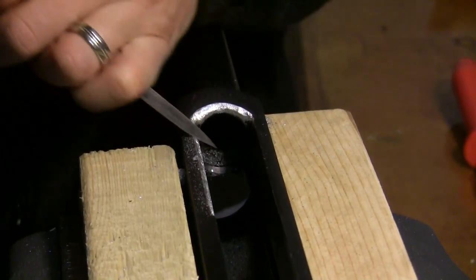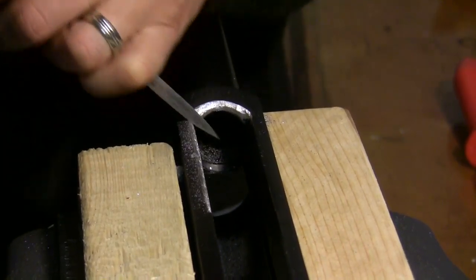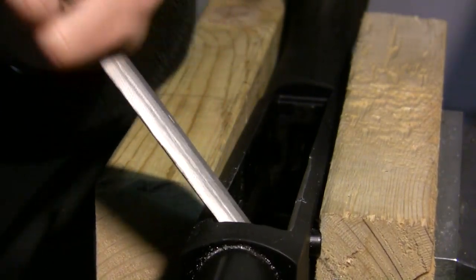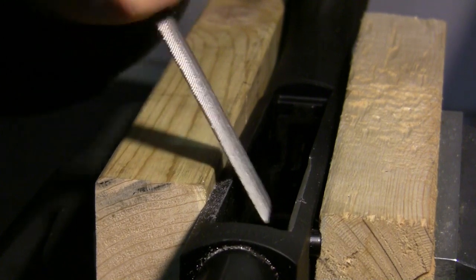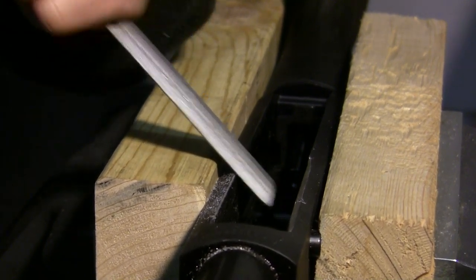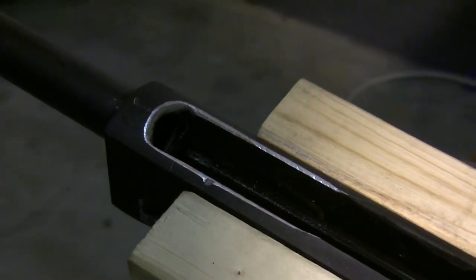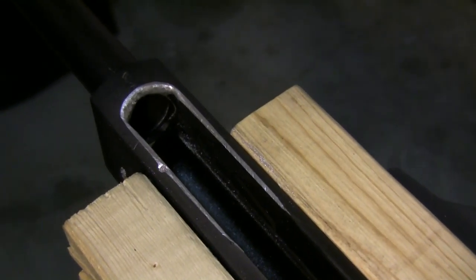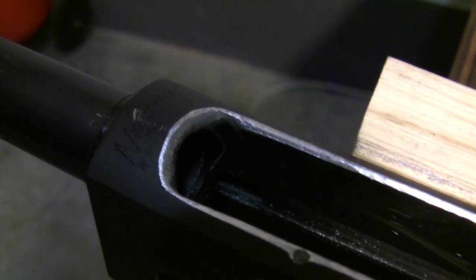As you can see, there's a little pin right there. I wanted to make sure I had all the sharp edges off the surrounding area of that pin — it's a pin that actually holds the bolt catch in. I didn't file anything off the pin itself, but I made the edges around that pin in the receiver smooth so they're not catching your finger or fingernail as you're loading. Now for the final steps, I turned the receiver around and worked on the opposite side — the weak hand side. That's pretty much my finished product, still pretty coarse at this point. You can go back with a Dremel with a fine polishing head and really put a nice shine on it if you want. You can see right there how far I went up — I went up to where it says North Haven, Connecticut on the receiver. That was where I stopped.